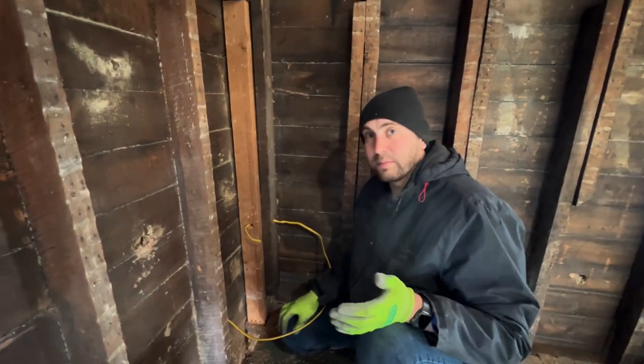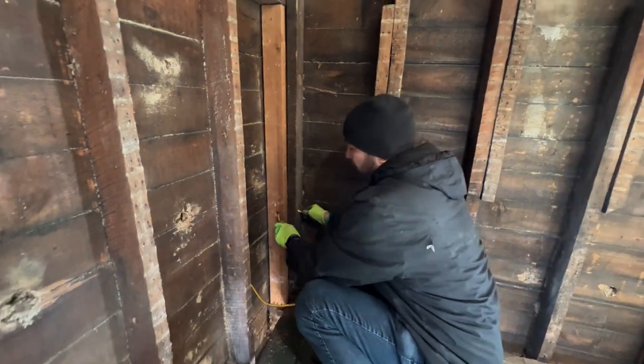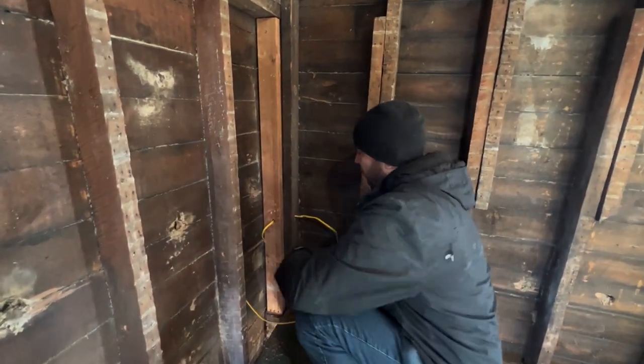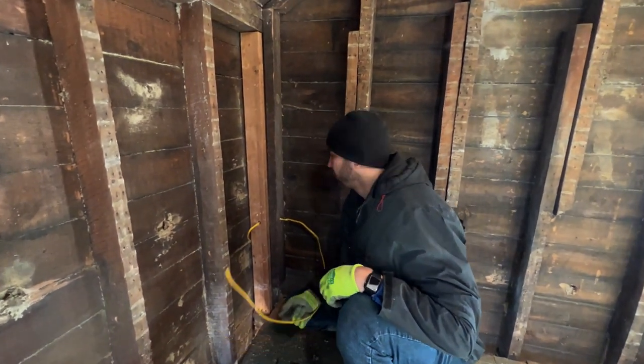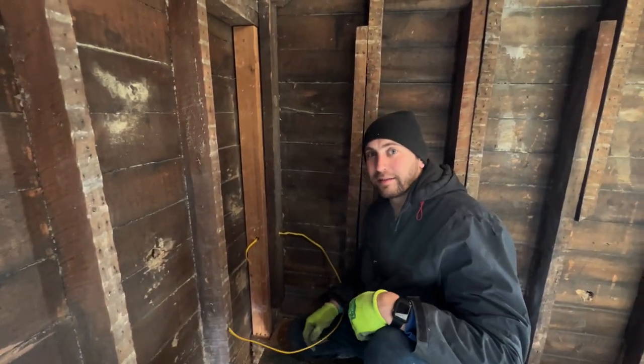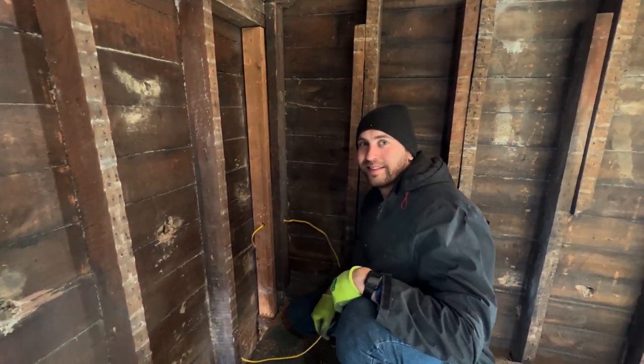I like that anytime something's close enough, or too far out on the stud, but I think we're in the safe zone here with a half-inch drywall using an inch and a quarter drywall screw. So that's it. Hopefully you guys learned something. I'm constantly learning, but I love to teach what I learn. Thanks, guys.